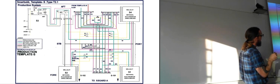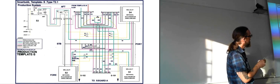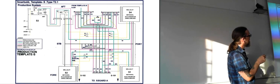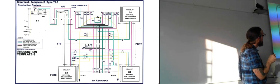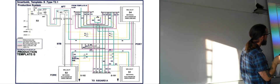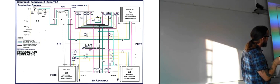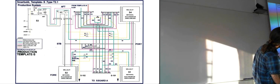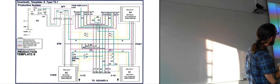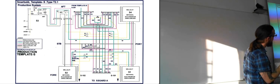So we can recognize this one. We have the surface control subsurface safety valve down here. Annulus master valve, we are moving up. We have the production master valve. We're going over here. Production wing valve. And the wing valve for the annulus also. All of this goes into here. Now we have the control parts. No, that's the tree cap, basically. This is the tree cap parts. And then we are getting into the manifold.